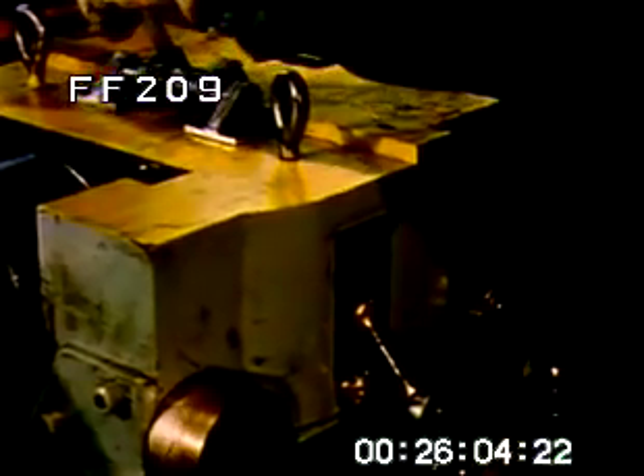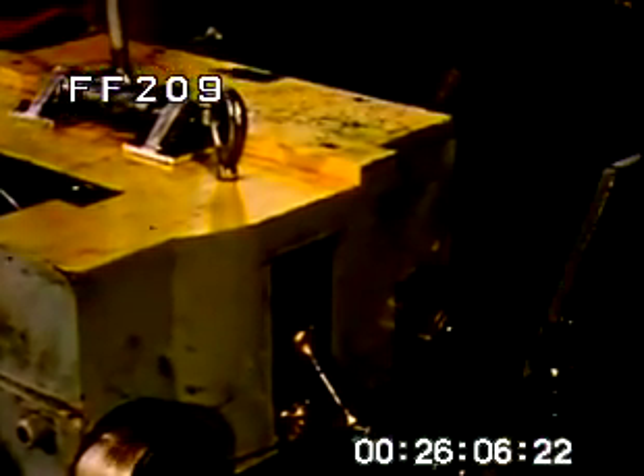The third major type of gold-filled stock is tubing. But here, unlike wire where carat gold is bonded to base metal, the tubing itself is of gold-filled material. This is slipped over a removable steel rod and drawn to desired thickness. Each step of the way will stretch it longer and thinner over the removable rod. Tubing like this eventually may be used for the finest pen and pencil sets.